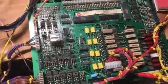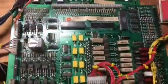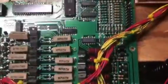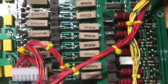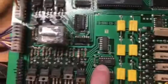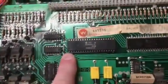Okay, today we have Jeff's System 6 CPU and driver board. These were hanger queens, as I call them. People had scavenged parts off of it. These transistors here were missing, and there's 3 TIP42s and even a 27 ohm resistor, and there was a resistor missing here. It ended up having a failing 7408 here, and one of the PIAs was failed also.